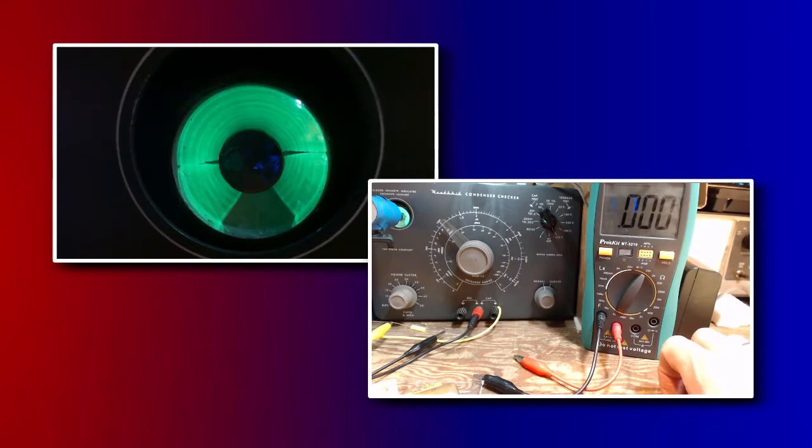And in some cases, a leaky capacitor is not going to cause much trouble in the radio, because there's not a lot of voltage stress across it. But when tested on an instrument, the same leakiness will throw the readings off.